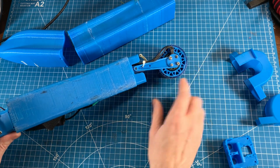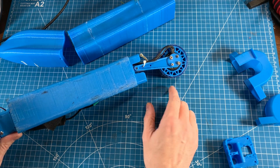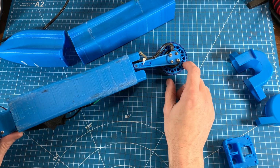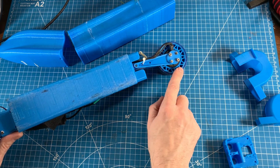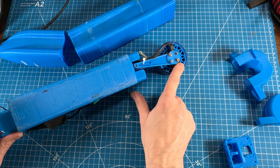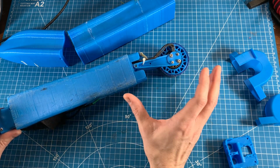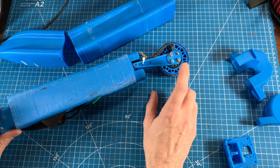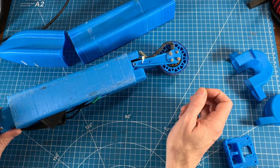The other thing I'm going to do is, of course, increase the sidewall significantly of my next tire design. And I may actually use rubber for the outside layer, and then have a layer of TPU, and then I'm most likely going to reprint this out of nylon, which was always my initial plan. I'm going to make it much more flexible and kind of almost go along the lines of a tweel, which is kind of what Michelin has with the airless tire. And that I'll make these spokes flexible, so they'll only be probably like 0.8 millimeters in thickness.